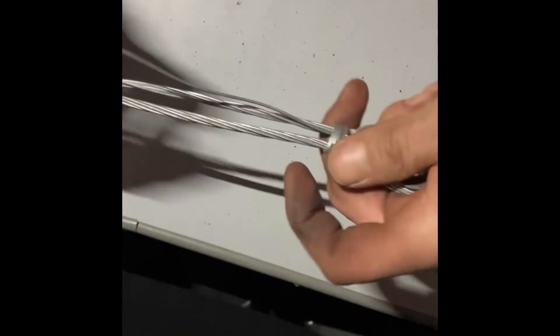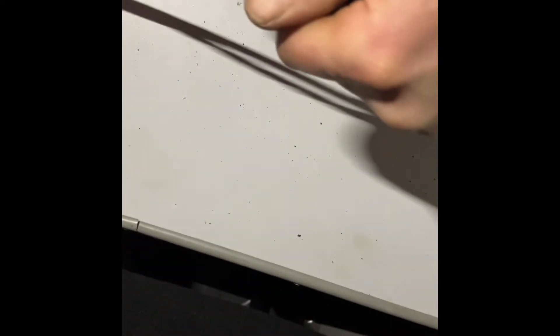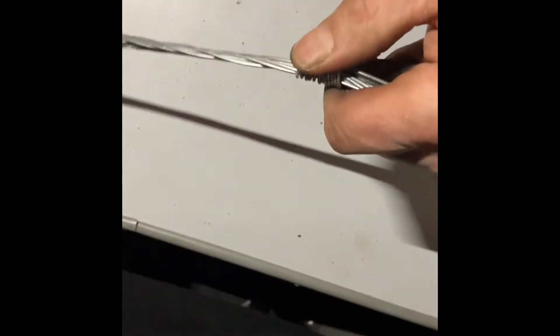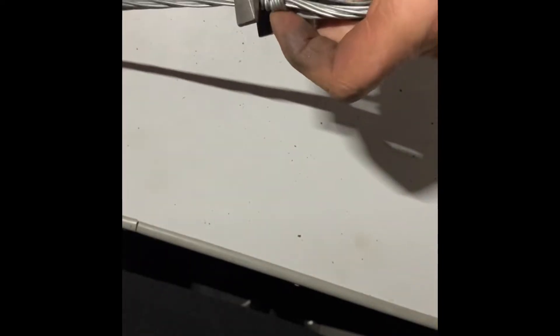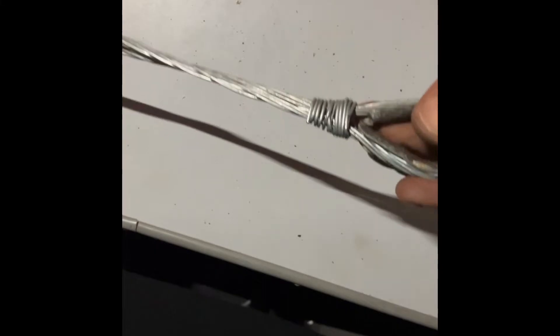Make sure you get the wire all the way right down to the very end — you don't want to get the wrong one. When you get it down to the very end, pull it as tight as you can at 90 degrees — that ensures it's trapped up against there nice and tight. Keep it as close as you can, anchoring your finger while you get in position, pulling as tight as you can. As you work your way down, they get tighter and smaller and should eventually get quite neat. You should be able to run your hand over it without causing much problem.